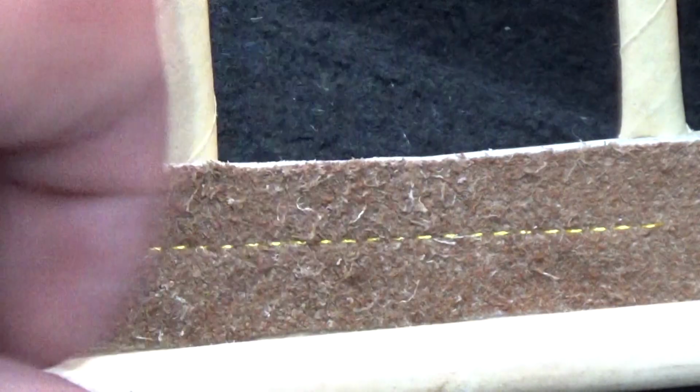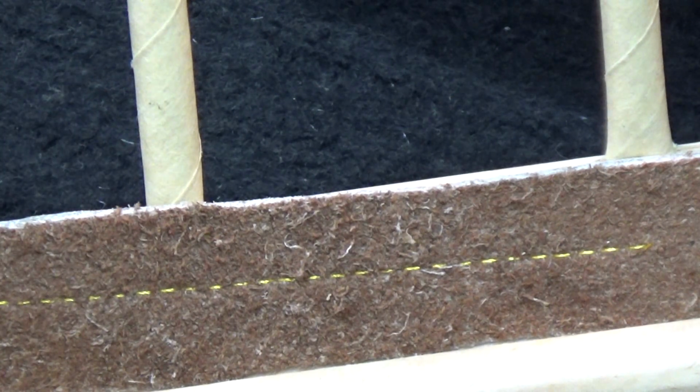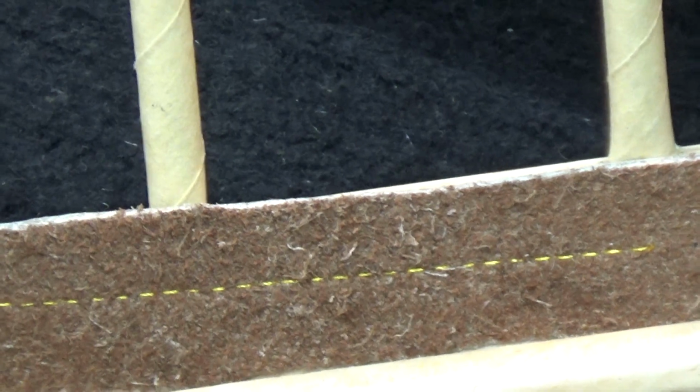Let's look at that lock stitch before we strut too high and too fast. There's totality of stitching, and I'm seeing some good stuff. I don't know about you. Let's zoom in on it and take a look. See if that upper tension that was absolutely non-functional when I started on Marc's machine did its job. Because remember, that upper tension again is going to define that lock stitch. That bobbin hook system in the raceway is going to define the top stitch.